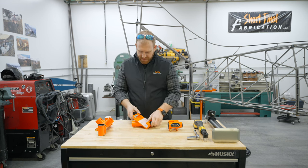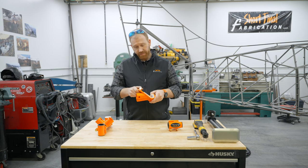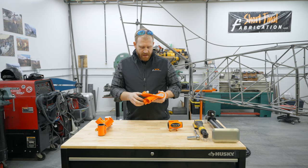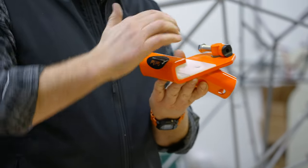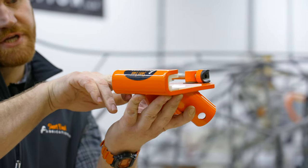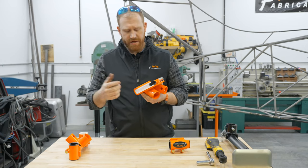In the Cessna jack, this one's a little bit different, because all of the tail-dragger type Cessnas — 140, 170, 180, 185s — have a spring steel, some in titanium also, landing gear that's flat. This essentially has a piece of 5/16ths plate that's been pressed and broke around to basically capture the gear. There's a machined bushing with a groove in it, and that's for a number 3 brake line to slide in, so you don't have to remove your brake line off the back of the landing gear.